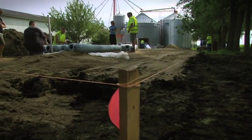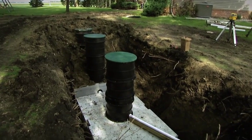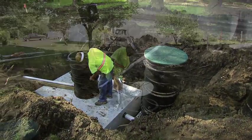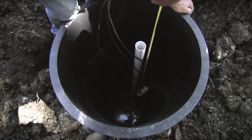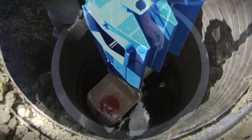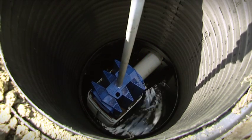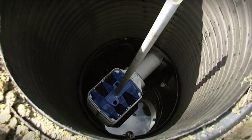I'm Denny Sueva from eastern Minnesota. We have a septic installing business. Today we're installing a mound system. We have a series of tanks here — 2,000 gallon septic tanks and a 1,000 gallon pump tank. There's an effluent screen in the back of the second tank before it goes to the pump tank, just to keep the pump clean and keep the solids out of the pump tank, so in a closed system it stays just gray water.